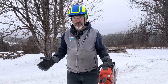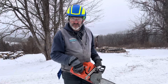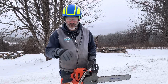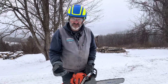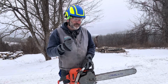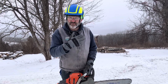Why not keep that bar pointing backwards? I see so many people — doing the right thing, engaging their chain brake before they take more than two steps — but then walking around the job site with the bar in front of them, looking for the next cut to do. If you trip over something you can't see because you're looking too far ahead, or you're in the snow like today, there's dozens of sharp teeth that even with proper PPE you could still fall on — open up your wrist, your face, your neck.